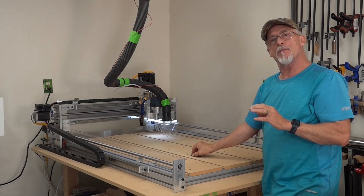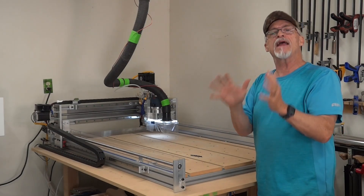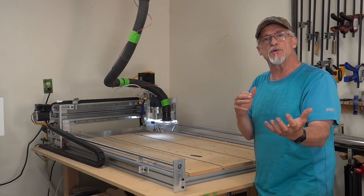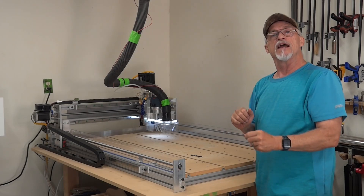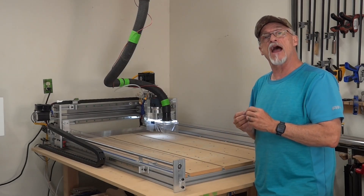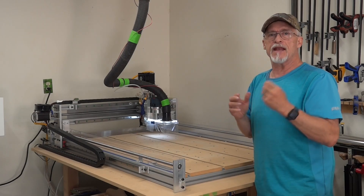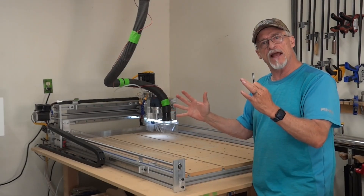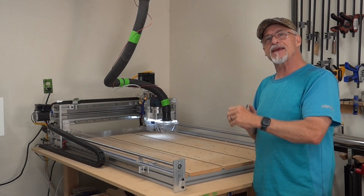If you're thinking about putting a diode laser on your CNC machine, understand that it's going to be painfully slow. It will engrave beautifully — I made some absolutely beautiful engravings — but it's very time-consuming, and from a cutting ability standpoint you're not going to be able to cut much. If you try to cut eighth-inch material, it's going to be very, very slow. Because time is money — I do this as a business — I needed something a lot faster. Just remember: CNC speak is inches per minute, and laser speak is inches per second.